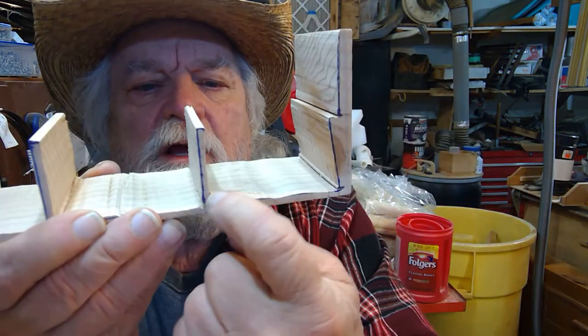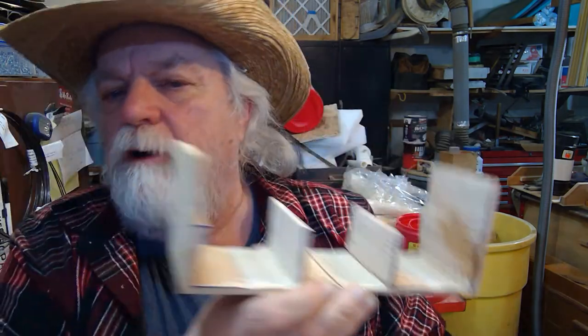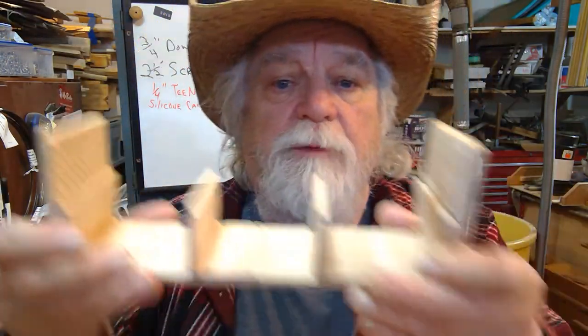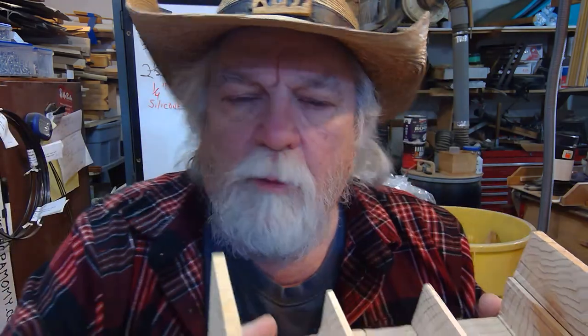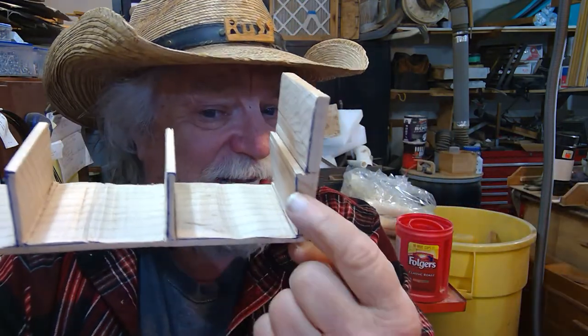I used a 1/4-inch blade because it's a little more durable than the 3/16, and you get much better control of your line staying nice and straight when you're cutting with that, as opposed to the 3/16, which can get a little more wavy. It's a little harder to hold it straight on a line. And since I was cutting these out to a nice crisp corner instead of doing this in one cut where I would have to curve, then I would go into the 3/16 so that my curve would be a lot less. Because curving with this 1/4-inch blade, you're going to have a 5/8 radius on your curve. And if you go with the 3/16 inch blade, then instead of 5/8, that's about a 5/16 of an inch curve.